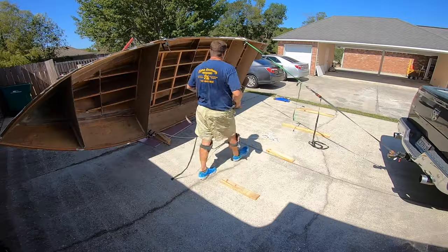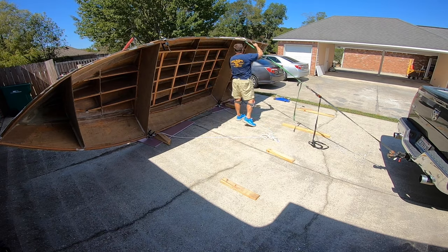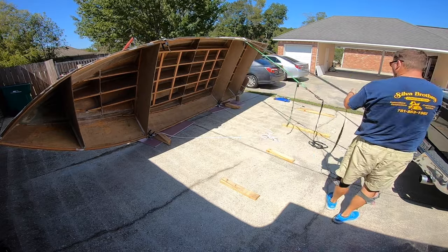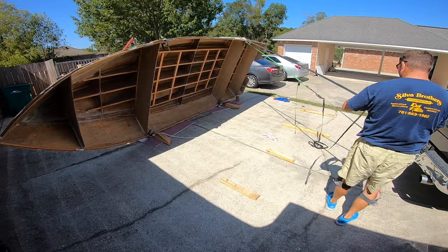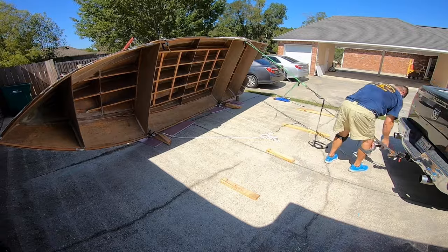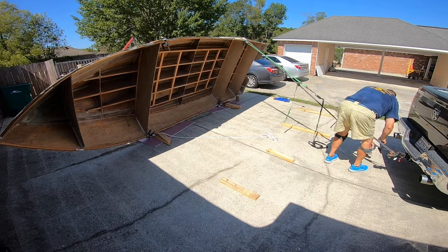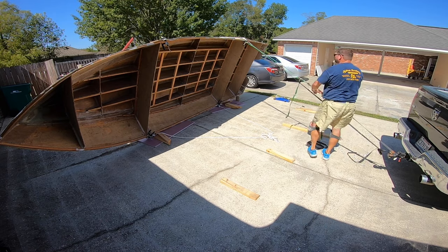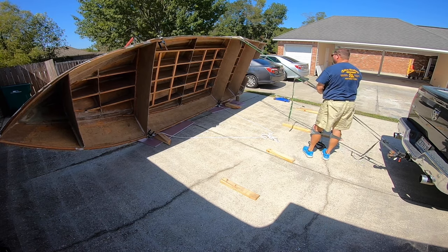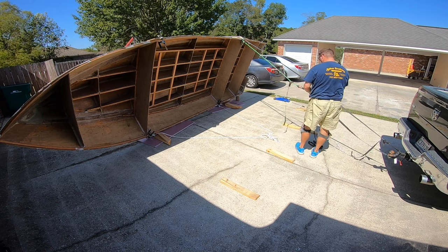All I need is for that thing to just kind of roll over a little bit. So right now I've recognized that my task is I've got to control how this thing rolls over. My thought, as I was able to wiggle that strap, is if I use two straps and I loosen one while the other one is tight, just a little bit looser, and then I alternate back and forth, I could kind of step it down, and you'll see that's kind of what I'm doing.